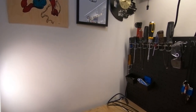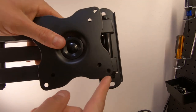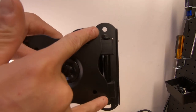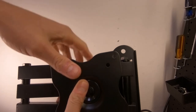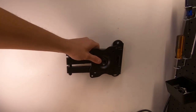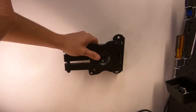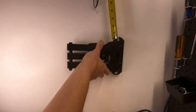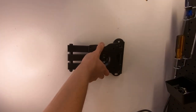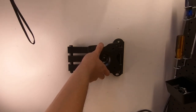Let's make the holes and take height into consideration. I took the mount and used the reference hole on the back of the monitor to measure the height from the hole to the top and to the bottom of the monitor. That way I know how much the monitor will stick above and below the mount point. I measured five inches to the top and six inches to the bottom, which gives me plenty of clearance from the bench bottom and won't interfere with anything mounted above.